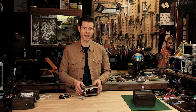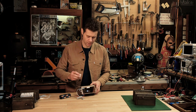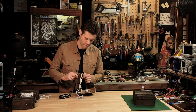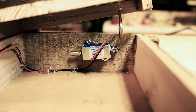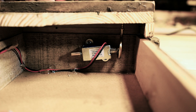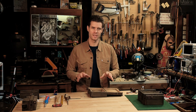This is a cutaway I made of the inside of the box so we can see it in action. When I use the magnet to trip the solenoid, you can see there's a brass hook here that catches on the shaft of the solenoid when it closes — that's what keeps the box from lifting open. When we use the magnet, it frees the solenoid from the hook.